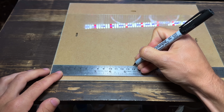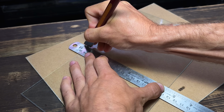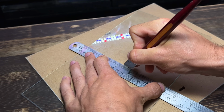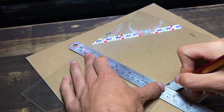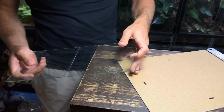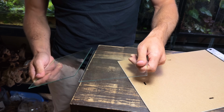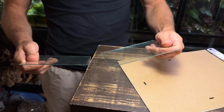One important thing to note when cutting glass is to only score the glass once. Going over the same score line more than once will quickly blunten the glass cutter, and you can also be left with jagged edges, which isn't what you want. Another way of breaking the glass is by gently tapping the line on a straight edge. It breaks easy and it's nice and straight.